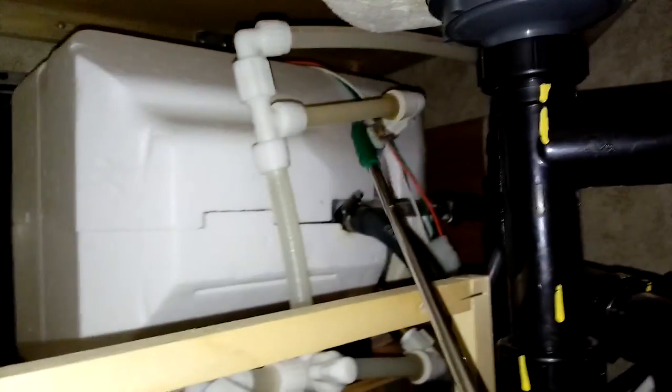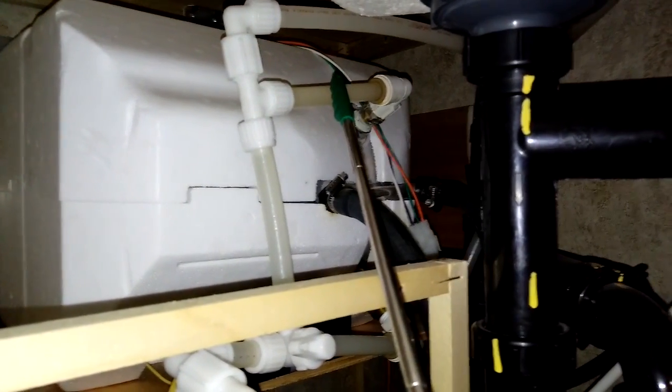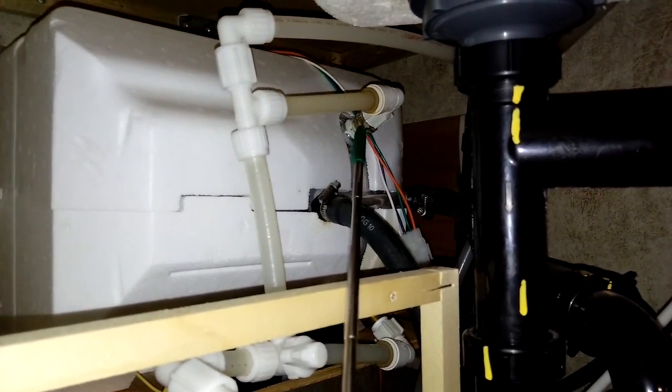The issue was I didn't have water coming out of this. That check valve — when I was searching the internet, they said some of them are made out of brass, and from other videos I saw it turns out that this little brass piece right here that comes right out is the check valve. So far I've turned my main water off and then drained the hot water heater by opening the drain plug, which I'll show in a bit. Once I drained the water heater, I won't make a mess. I've taken off that hose — you can see it's disconnected, it didn't drip very much — and then there's that brass piece which I have to reach and unscrew.